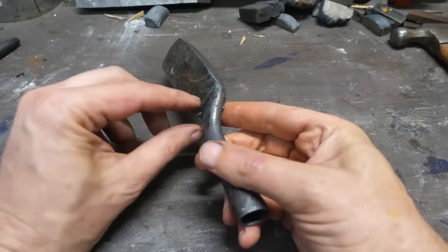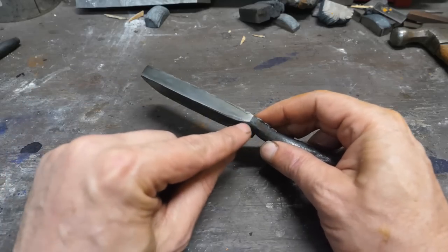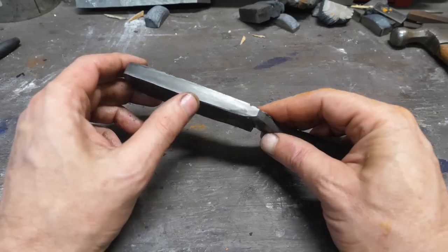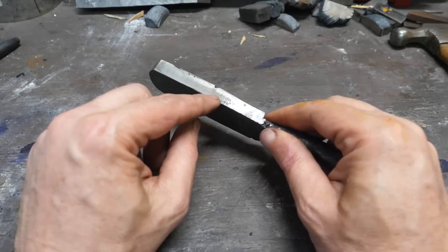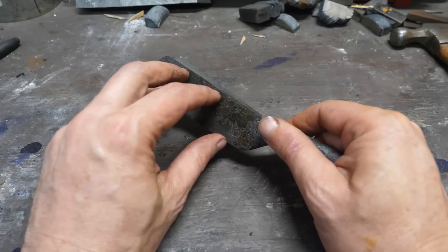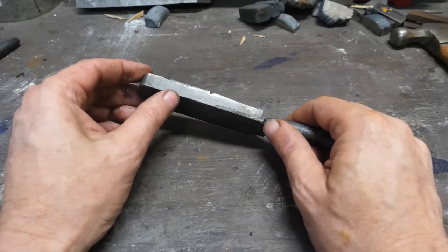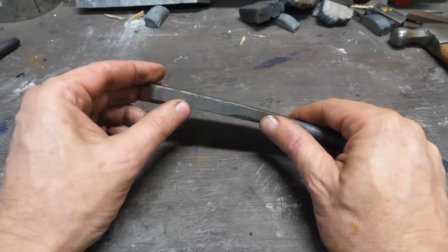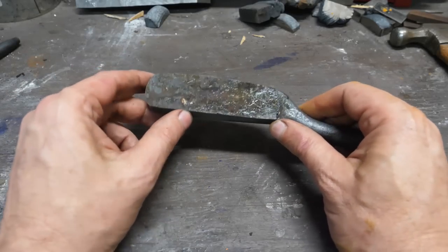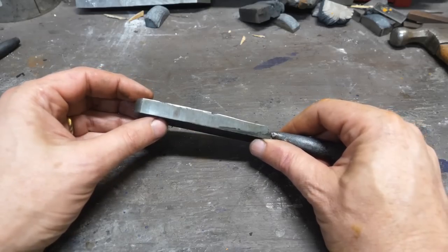This should be the hardenable steel — I left the handle attached. That was the one we checked to be hardenable after the test quench, and it should make up almost all of this edge. It just doesn't etch much differently than this other edge, which should be the welded-on clubface. The third clubface obviously exploded, so we can't count on that. They don't etch that differently — I'm wondering if it's all somewhat hardenable. So I'm going to go back and quench it and check both sides.